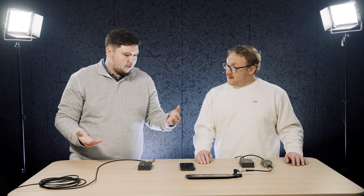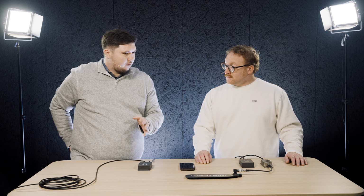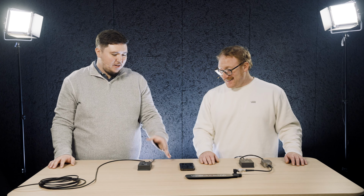So if you're on a large performance venue stage, and you have in monitor world stage left your transmit antenna, but you need to put your principal artist out on a 100-meter thrust, you can put a fiber zone out there, and as they walk from one point to the other, the belt pack will never have any phasing. It'll just continue going as long as there's signal. Yeah, the true diversity belt packs, the MPR50. That's also the big advantage of working in true diversity, talking about a receiver. It all goes together as an ecosystem.